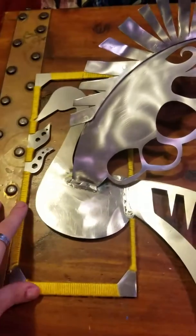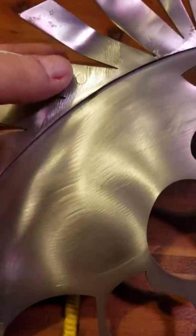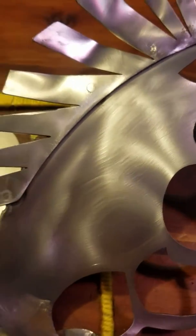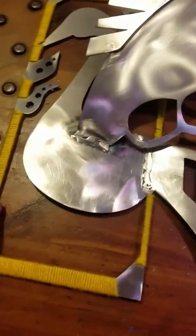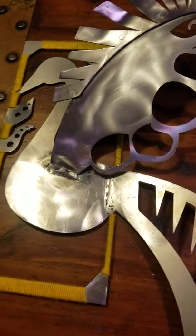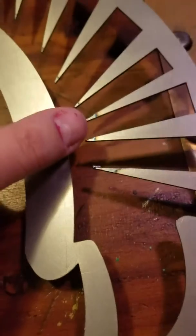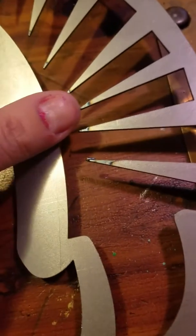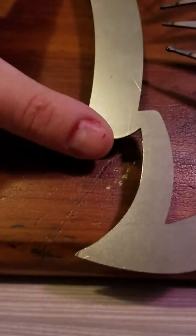That's a re-overview of what I hope to cover. You can actually see where I tacked it on the other side to keep it in place — I probably could have ground that down a bit more so it didn't show. These videos will probably highlight a lot of my processes. Here's some heat damage from the laser — points are a little bit difficult to do with lasers at times if the heat output is too high; it'll burn the metal like that. I kind of left it there as an example of what can happen. For other points you can see it wasn't as bad.